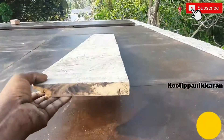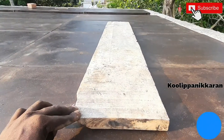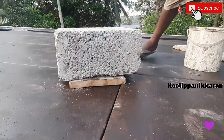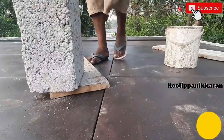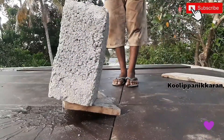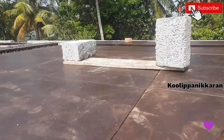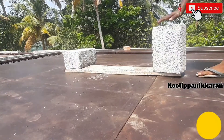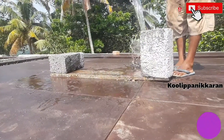With a twisted board, you have a high spot here and a high spot back here. If I use the normal two-paddle technique and push down on the infeed, then get to the outfeed and push down registering on the outfeed table, as I go across my pressure changes. Now I'm pushing down on the wrong side, getting this side thinner rather than that side. By changing pressure mid-pass, I'm getting myself into trouble.